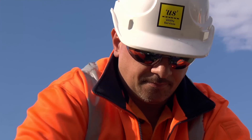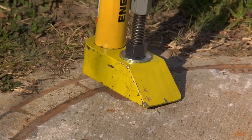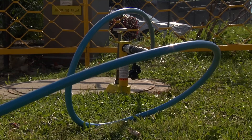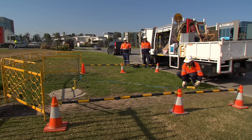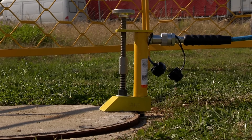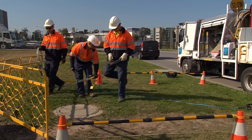So the Canadians came up with this idea that you can open it from a safe distance. It's got a piston on the outside of the manhole. You've got your hose that comes out so you're at safe distance from the manhole. You pump your hydraulics up, the piston pushes down on the outside of the frame of the manhole and the gatic lifter brings the lid up so it breaks the seal. Once it breaks the seal, you go and lift the lid normally without being under any pressure.